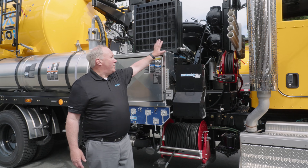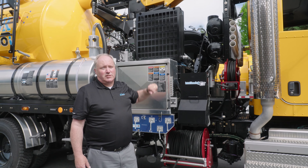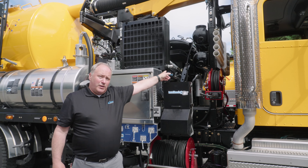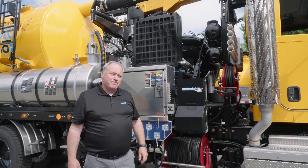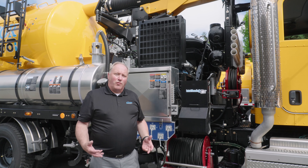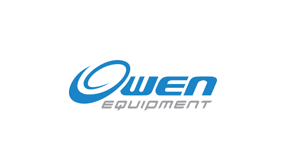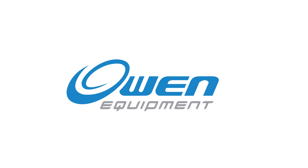We've added a few minor things. This may look like an engine radiator, but it's actually a hydraulic cooler. And there's a pump over there that's running the fan on the backside. Overall they've been trouble free with no problems.